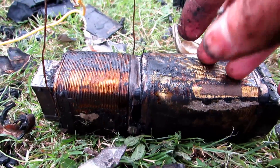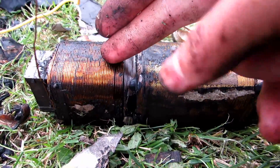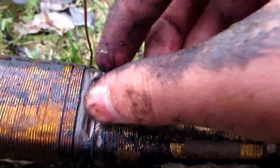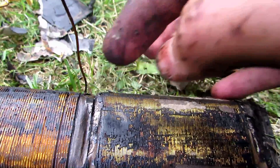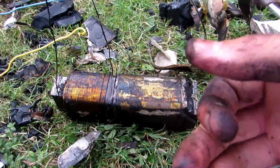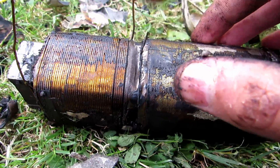With all the paper gone, you can see we have the primary coil and the secondary coil. But in the case of my hydrogen generator, this will be the primary and this will be the secondary, because I want it to be a step-down transformer. I can see why I messed up last time - this little wire here is one lead from the secondary, and it is so small it could easily break off and be lost. What I have to do is remove all of the coating on this one and solder on a separate wire.